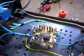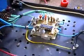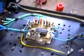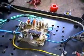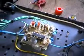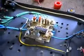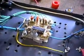So I'm going to have to clean all that out and put another capacitor on there. I think what I'll also do is I'll put maybe a 10 or 20 ohm resistor in series with the DC power going to the electronics control board. That way it'll buffer the current of any of that transient voltage trying to get back into the controller board. I'll be back later.